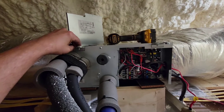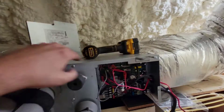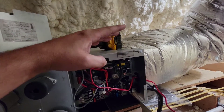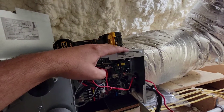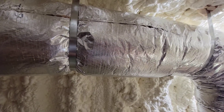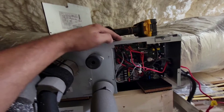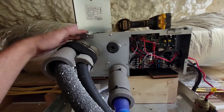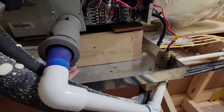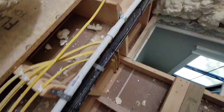Typically these units are installed using these brackets — you use some all-thread, and sometimes unit strut, but mostly all-thread. Or you can use a hung-right bracket; we've used some of those, but we had to run the return over so you can't really mount the unit that way. It's a pretty easy install, but you've got to have a float switch, a pan, and you've got to make sure you have a place to clean out your drain — and we do have that as well.